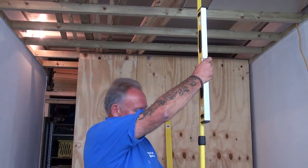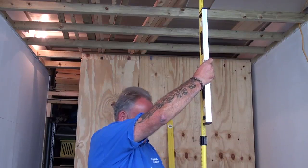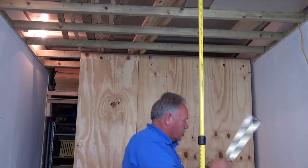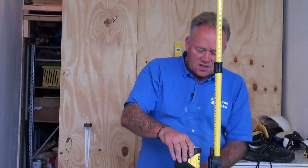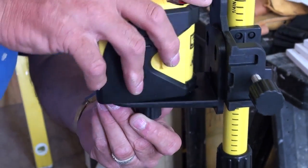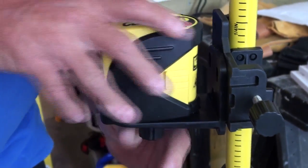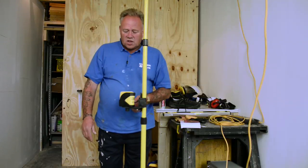Move it round the pole so that we can get it as close as possible to upright, but it doesn't have to be perfect — if it's within half an inch or so, the self-leveling laser will take care of the rest. Once that's set up, the laser simply clips to the L-bracket which is clamped to the pole, so it fits nice and snug. If this is reasonably upright then the laser will take care of itself.